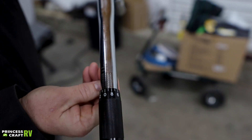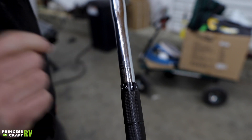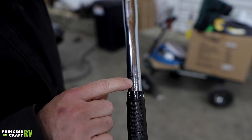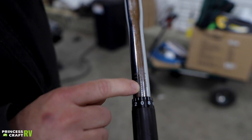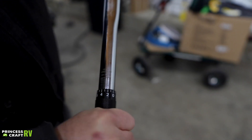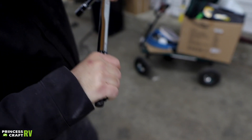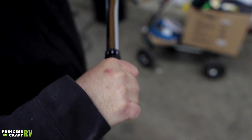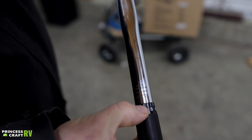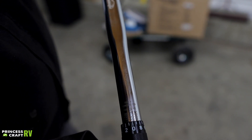Now all of the lines on this torque wrench kind of come across and then drop down a little bit. So your zero is not going to be straight across from your 100 — it'll be just down a little bit on the line there. You can see that I am not exactly across from the 100 because the line does drop down.